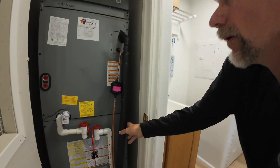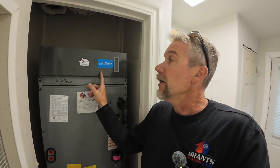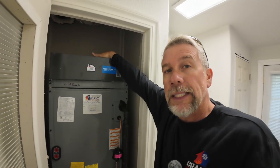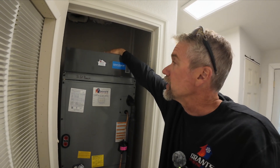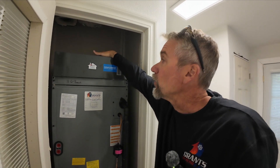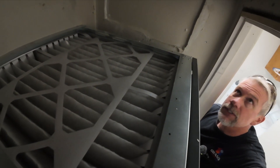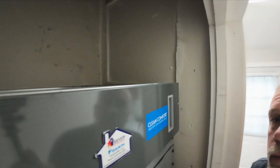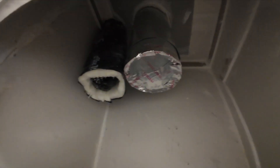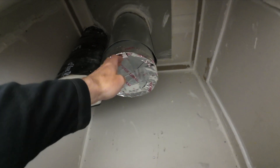We have a bi-flow filter dryer here. As I've shown in my other videos, we love our 4-to-5 inch filter — optimal cleaning, low static pressures, and up to 6 months between filter changes. With an open plenum design on the return, we just leave this open to the box in here, just as the other furnace would pull its air from this room. We do cap and insulate the direct vent and shove insulation up in there so that we don't get any condensation and water dripping down.